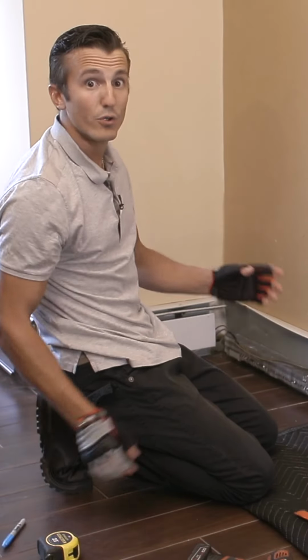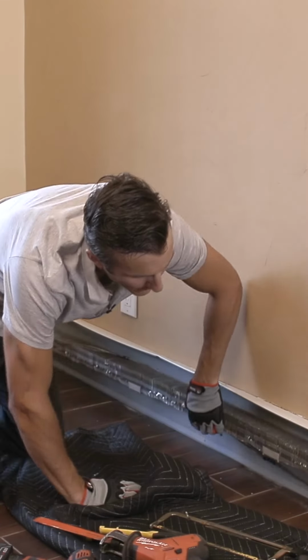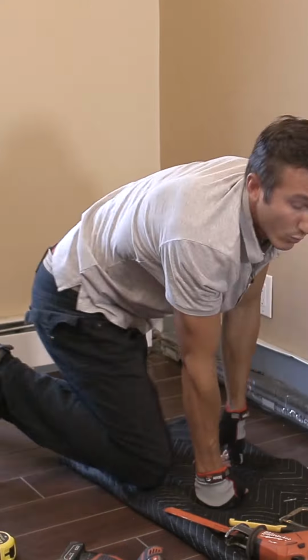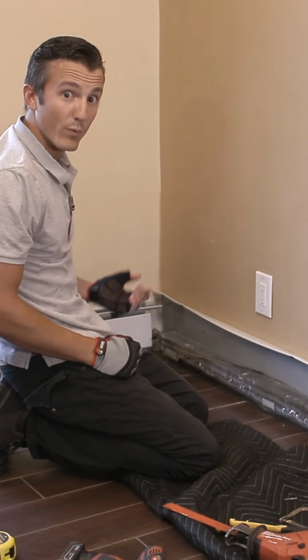There may be some screws underneath the element, so it helps if you just bend the element up and take a look. Once all screws have been removed, the back panel should come out with ease.